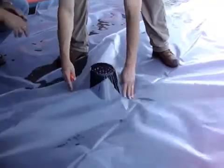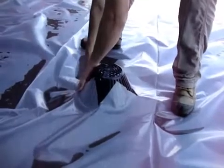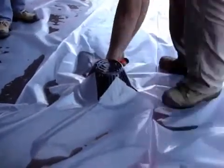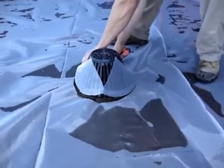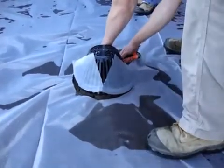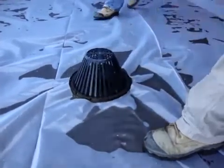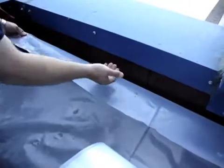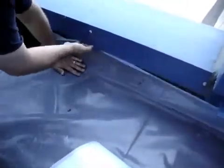Typically, what you can do is just a cross section cut, and then you push it down. Once we've cut the X, we're going to cut around the drain pipe, nice and tight, all the way around. Be sure not to cut into the waterproofing membrane below. When cutting the root barrier, be sure that you leave enough overlap so that you can cover and tuck it underneath the parapet to cover the actual waterproofing.